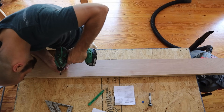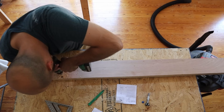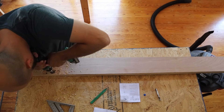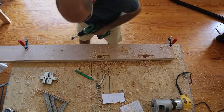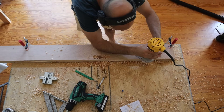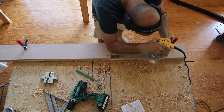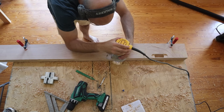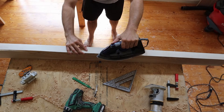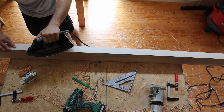I took the frame back out to add the mortises for the hinges. Once all the holes were drilled, I used a router to smooth everything out. This was my first time using a router, but the most difficult part was really just learning how to adjust the depth of the cut accurately. The last thing to do before this piece was ready to go up was to apply some iron-on veneer. The iron heats up the glue on the back and allows it to stick to the plywood, and the veneer looks a lot better than the rough edge of the plywood.